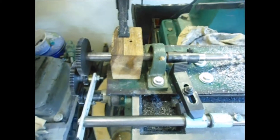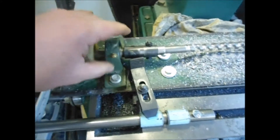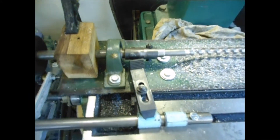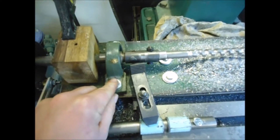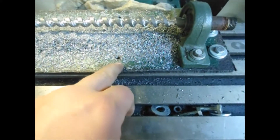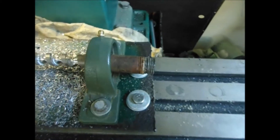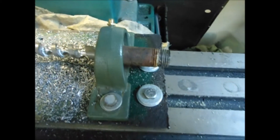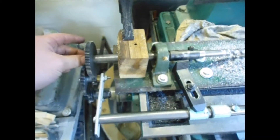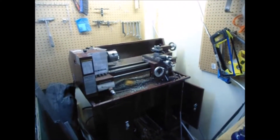The reason for the underlying piece of steel is that I wanted it to overhang so I could accommodate my drive arrangement and have it fairly well fixed on the plate. Besides the t-nut attachments, you've got a couple of pillow blocks that allow you a little room to maneuver and adjust things. You can also see a couple of other holes that were tapped for a smaller project. The reducer is just a piece of two-inch scrap pipe, and this solid piece comes right from the change gear set from my Harbor Freight 9x20 lathe.